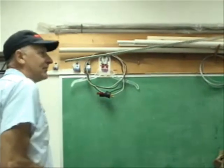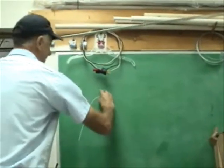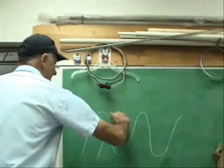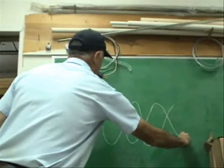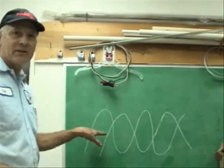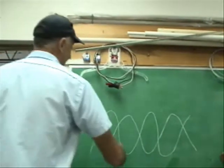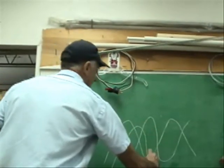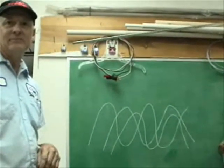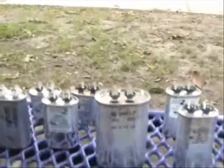What exactly happens in a single-phase 230 or 460-volt motor is, first of all, you have a sine wave of power here — that's one, and here's the other — and this gives you your 230 or 460 volts. Now, the run capacitor — what that does is it sort of fudges a little bit to tell the motor that it has three phases. So it creates another sine wave and, in essence, gives you three phases. Here are some single run capacitors. They come in all sorts of different sizes and shapes, and they also come in round.